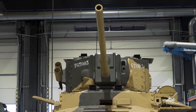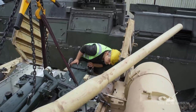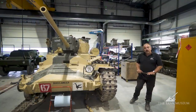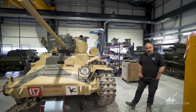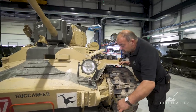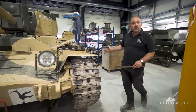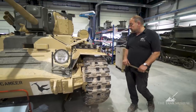When I started here in 2016, the first job I had to do was rebuild the gearbox on this Valentine tank. At the time the Matilda project was running concurrently, and because we wanted to push forward with that, the remaining work on the Valentine couldn't be done. I'm glad to say we can now revisit this vehicle and do the suspension overhaul that was intended to get done in 2016. Just to highlight some of the problems: the track-adjusting wheel here has all its mechanism gummed up over the years, with an awful lot of wear in some of the locking mechanisms. Once the track is split, this whole unit will be taken off, cleaned, and fitted with new bearings — it takes a lot of stress holding the tension of the track.